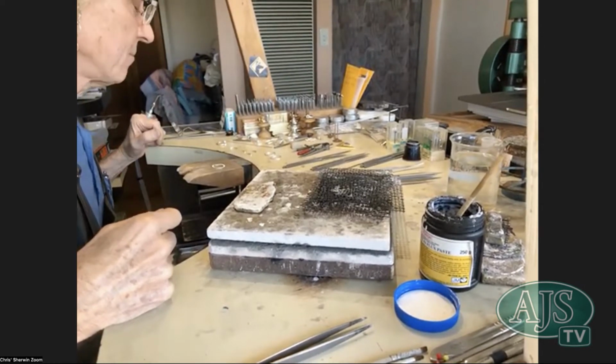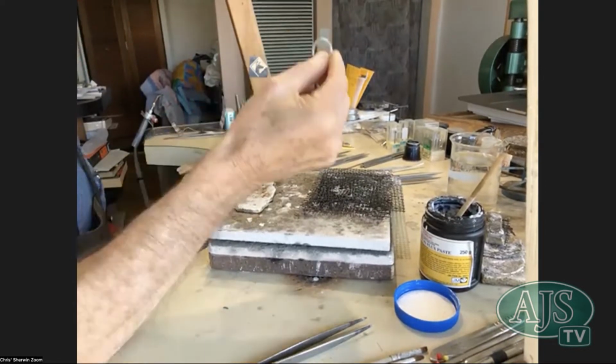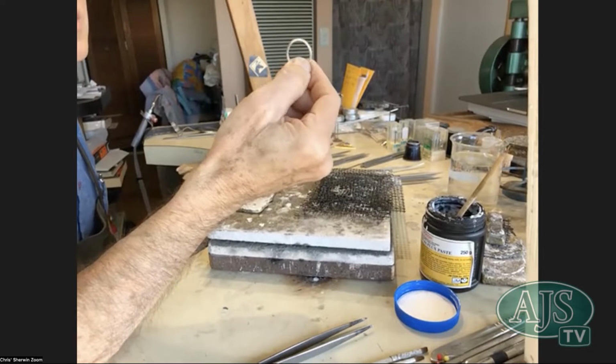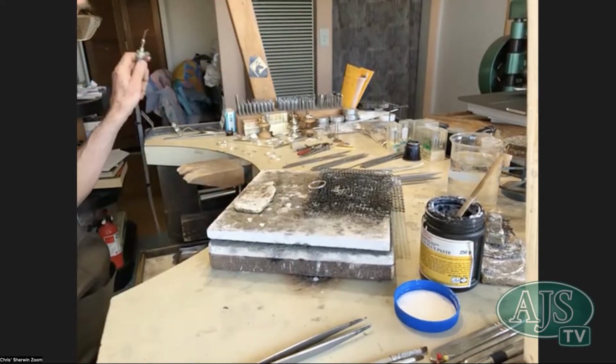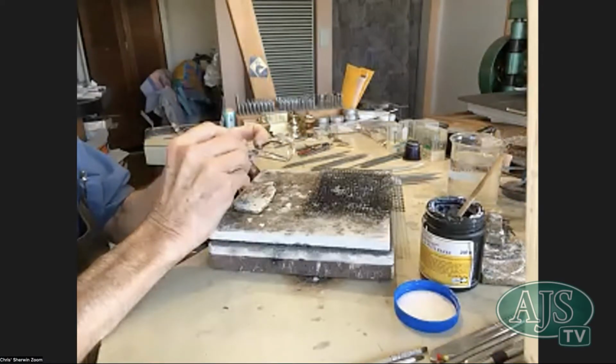So let's just talk about standard resizing. When you have a ring, these are just samples I've made in silver, and you want to, say, go up 5 sizes or 6 sizes, you need to identify where the join is in the ring. So to do that, after the ring is perfectly clean, you put that gently through the fire, whether it's gold or silver, and you just gently heat the ring up, or part of the ring where you think that the join is, if you can't visually identify it. And we'll just heat the silver ring up a little bit, and we'll see if we can oxidize this just enough to show where our join is.